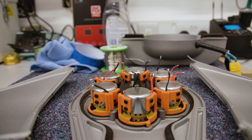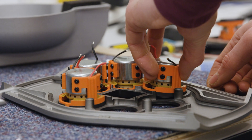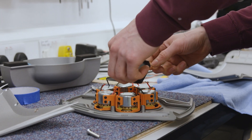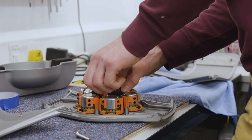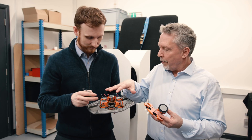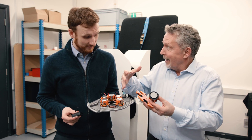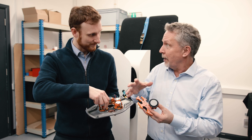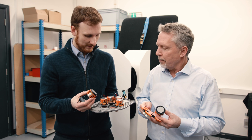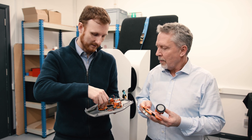These are fully custom drive units that have been engineered such that they fit in this way. It's really hard to show you, but there'll be some B-roll that will show this. You'll see how the tweeter sits on top of the edges of the mid-range drivers. And at least part — or all — of the reason for eliminating the bolts is to get everything as close as possible. There's absolutely no space in this design to have screws, so they all have to be migrated to the back in a clamping-type array.